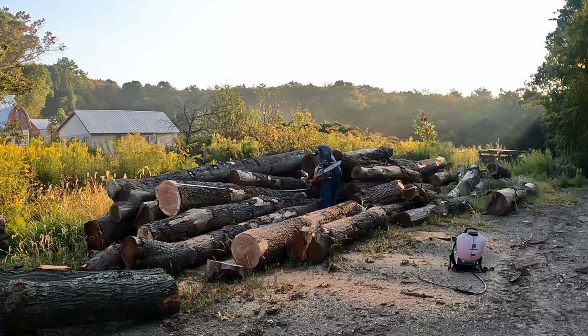But basically the way I'm sawing this stuff is from longest to shortest. That's always the simplest for me for stacking purposes. I do have some of this spoken for, but a lot of it I'm just sawing for inventory. So I'm just gonna try to keep the lengths that maximize the wood and give me the best grade. So should be some nice stuff. I always love cherry. I definitely love walnut. So I'm going to start cutting and sorting here and spraying with Anchor Seal and see what we come up with.